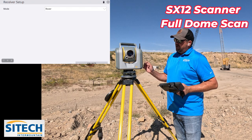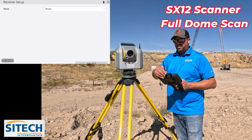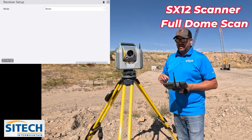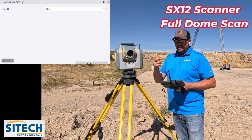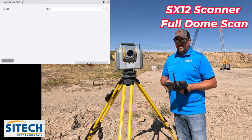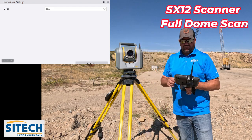So right off the bat, not knowing what the radio channel is, because you can hook into the SX12 total station with radio, and you can also do Wi-Fi. One thing that I'll tell you on that is some scans I've done in the past, I found that the data being written to the data collector, because when it's scanning, that data is not writing onto a card on here, it's writing to your program on here, and when I've done it with just using radio, it seems like the data collector has gotten laggy. So I found that Wi-Fi is the best. So usually when I do a scan, I'll get it started, which we will hear in a minute, and then I'll just set the data collector here and let it do its thing.